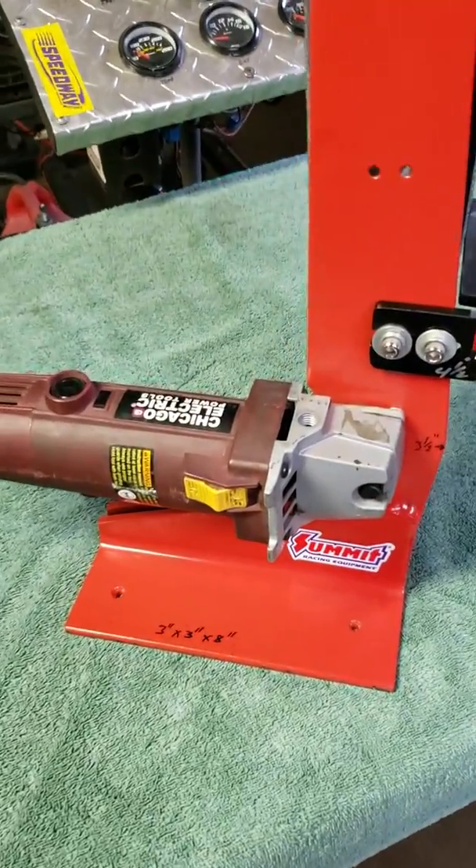The other side has one slot with two quarter-inch by 20-thread bolts. If you want to angle it, you just loosen it, take one bolt out, and change the angle. The main drive gear at the bottom I made out of wood, just like shown — it's two and a half inches from here to here, and two and a quarter inches from here to here. The center hole to the table is five inches. The first spring hole didn't have enough tension, so I moved it — that's why it's six inches from hole to hole, putting about an inch of tension on the spring when running.